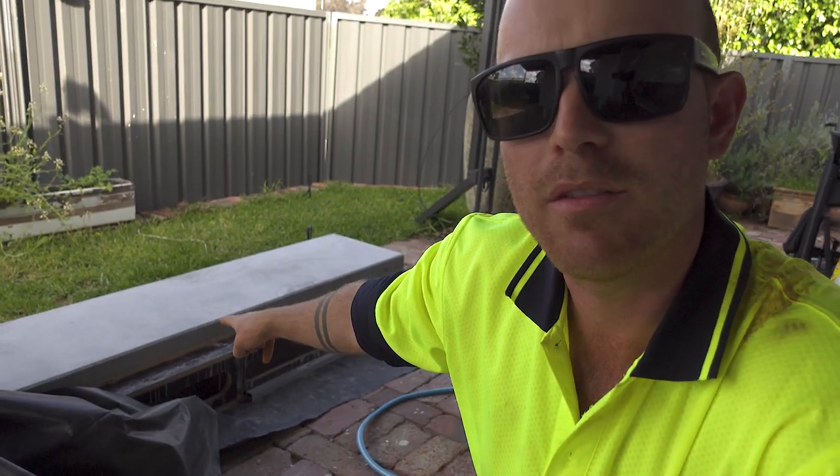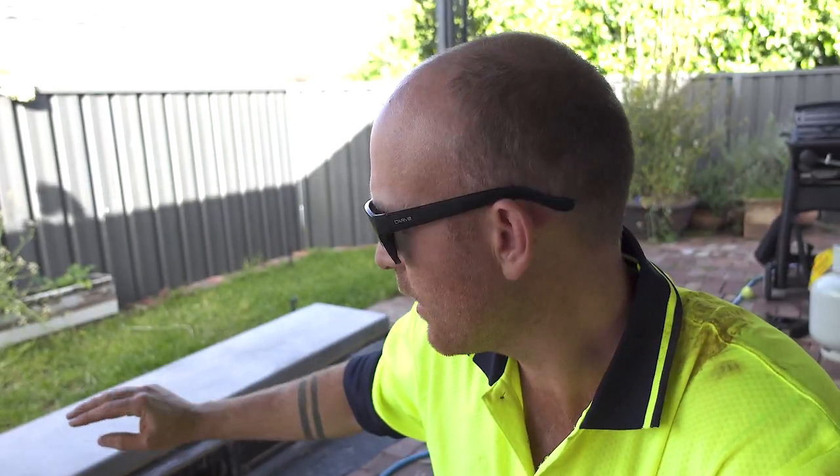I want to point something out about honing concrete: the way that you trowel your concrete has a big impact on how the honing process is going to go. With this one here, for example, I mag floated it, got it flat, and at that point I should have left it. But I got carried away and still troweled it — I sealed it up, but what that does is make the top of the concrete really hard. So that one has been quite a bit of work to get the top layer down to expose the stone. I didn't want to expose the stone very much but I need to now to make it match the other one.